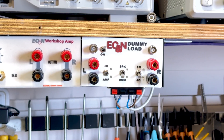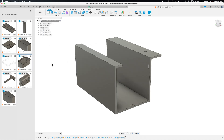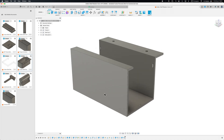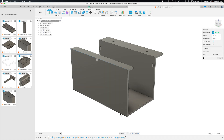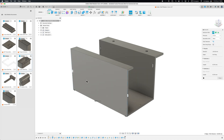That's why I designed these modules to be 3D printed. Say hello to Fusion 360 — this thing is amazing. This is where I model all the 3D stuff I need to print, and this is our module. This is the basic module shape. I've given it a length of 12 centimeters — 120 millimeters — by 65 millimeters high. 65 is a traditional convention because my original modules were 65 and a lot of the innards are designed for that height. What I have had a problem with is the width, so this 120 millimeter dimension I can just extend if I want.